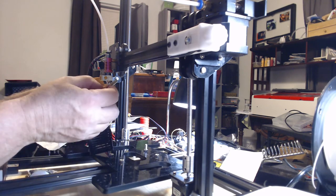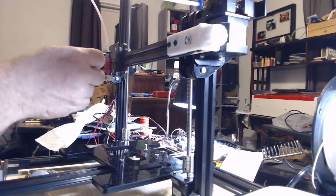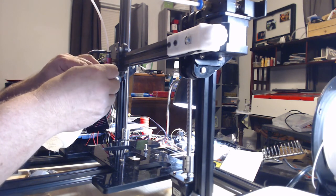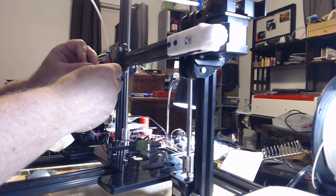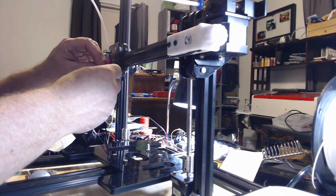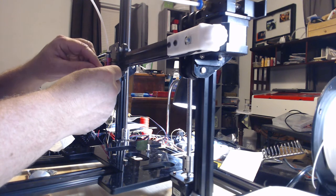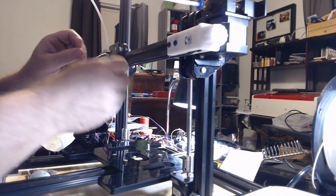Now I'm going to slide the heating cartridge in there and find that hole, and it's in there. I'll keep that in place and snug up my heating cartridge. If you're just doing the thermistor and the heating cartridge isn't an issue yet, just lay it on the table, and you're good for 2 hours. You want this to dry for a couple of hours just like this before you do anything with it. This has got to set up.